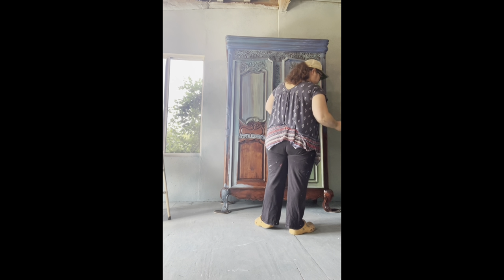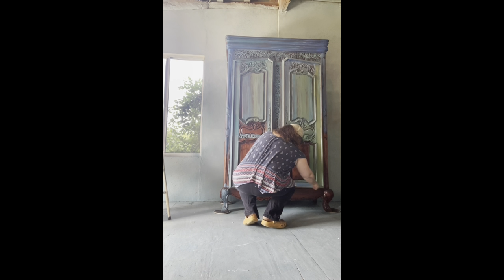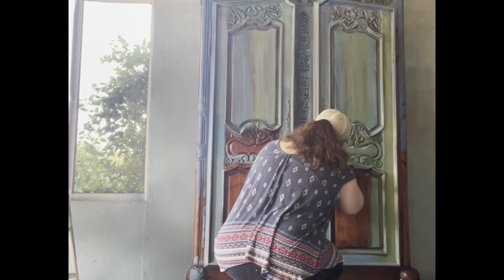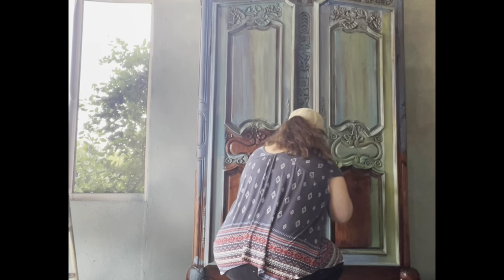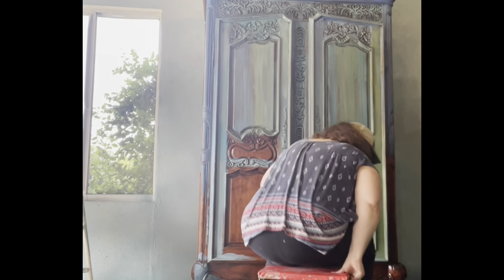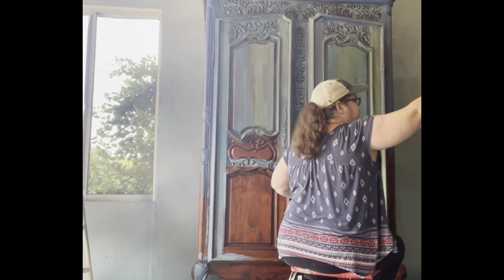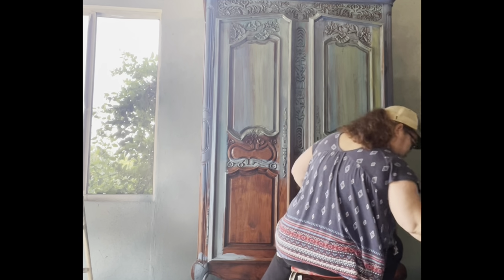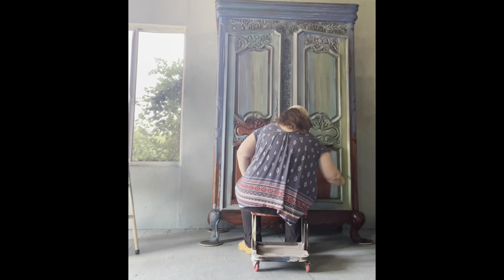And the detail part that you just saw, think of the word drift. Sometimes you just have a little bit of paint left on your brush and you may turn it sideways, and you just let a little bit of that paint drift off in a certain section. What you'll get is that very authentic looking old world or vintage look, where there are different layers of paint peeking through. So it's not about a big glob here and a big glob there, but a little bit drifted in, washed in, dry brushed on, wet brushed and smoothed, mixed together with other colors. You're just painting very fluidly.